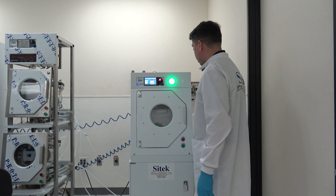For any system that we remanufacture for you, we're going to follow our same extensive process. We're going to take a system and completely disassemble it to the component level. From there, we're going to clean or replace all the poly to ensure it looks like new. We also take all of our metal and chemically clean and electro polish it, so all the metal associated with the system is cleaned in such a way that we have no possible contamination from previous use. SRDs are used all over in the fab — whether it's a traditional RCA clean, a gold or copper process, or in the lithography area. Our chemical clean and electro polish process guarantees the removal of all previous contamination, and that's guaranteed in all of our quotations.